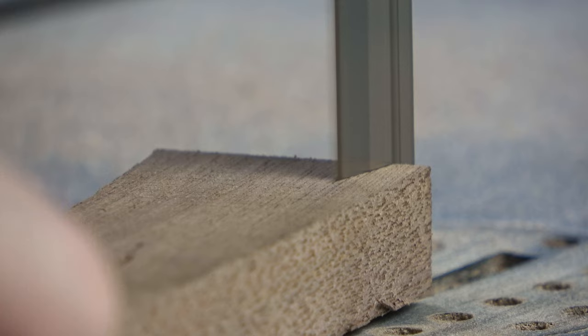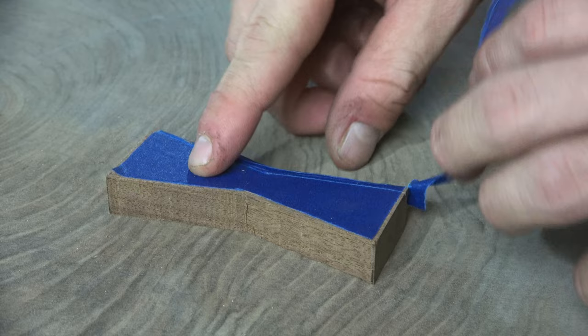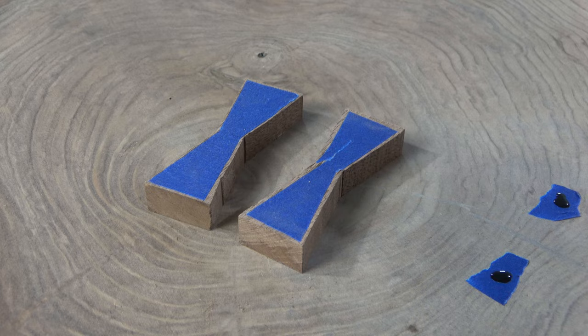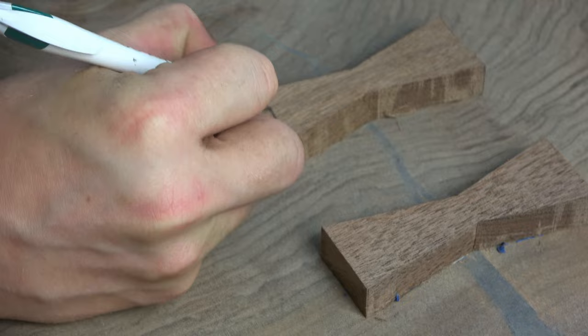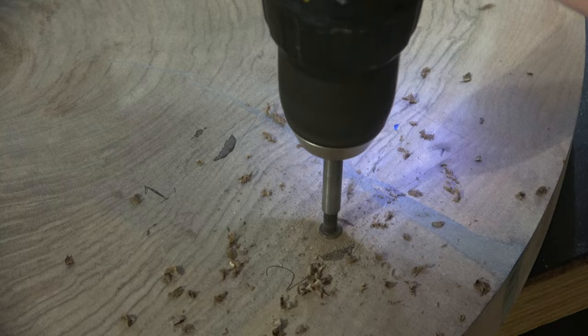This time I cut my bow ties out of a straight grain piece of American black walnut. They aren't going to match the Bastogne walnut slab nearly as well, but they'll do a much better job at stabilizing the crack and stopping it from spreading. They'll also be on the underside of the table, so the mismatch isn't a huge deal. I'm using a marking knife to cut a small indent into the wood so when I remove the bow ties I'll know exactly where to cut away the negative space in the slab.